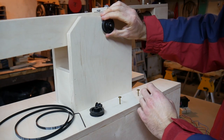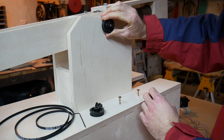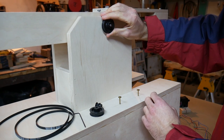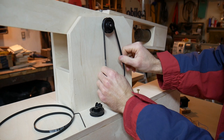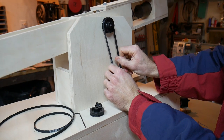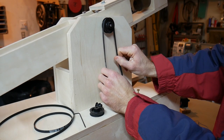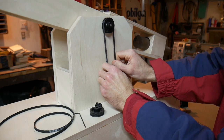The reason this is an issue for me is that this is going to take quite a bit of torque to get started, and I don't have a lot of experience controlling these yet. My concern is that you're going to miss steps and not be able to re-instruct it to go to the next step — you can only go forward and backward on the pre-built drivers I've seen. Those pre-built drivers have nice things like microstepping, and it's all tidy in a very small package with heatsinks built in. But I may also build my own driver, because it'd be really handy to manually energize a coil in one direction or the other and tell it exactly what you want it to do.